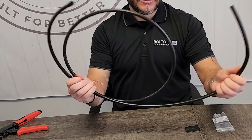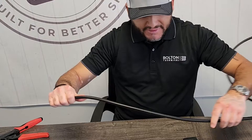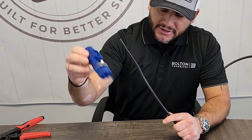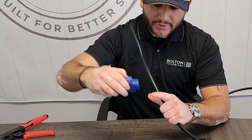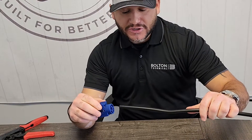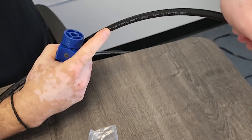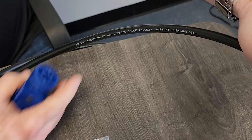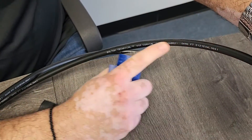The next cable will be the LMR 400. This is a smaller cable — same process but smaller, and it's going to use the same exact tool, an LMR 400 prep tool, same use, same entries in and out, same channel where you push it through and clamp down to prep the coax cable. To identify the cable, look on the cable and it will say 400 on the coax. These cables also show the footage when you're pulling out a new spool of LMR 400, so it has all the information you need to know the cable type and footage you are working with.